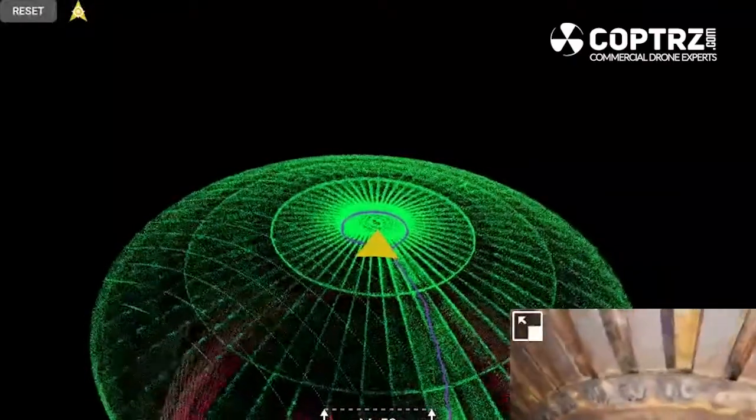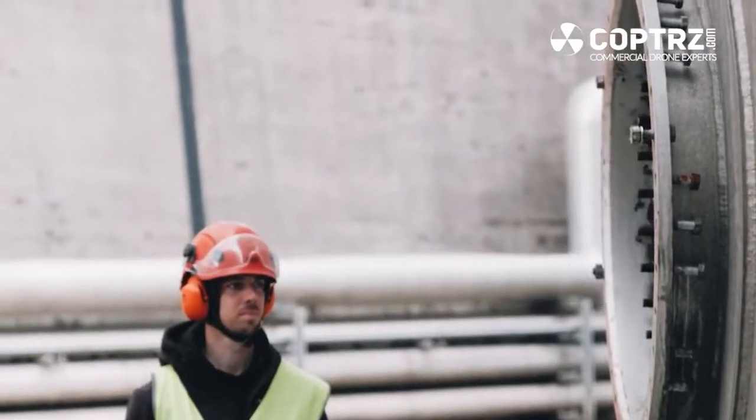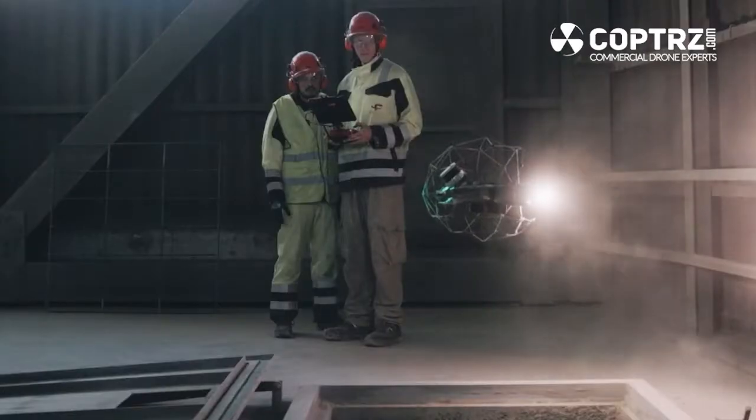Let's talk about one of the big improvements with the cameras and that is live streaming. Live streaming means what the drone is seeing and what it is being fed back to the camera operator in a mission. The Elios 2 operates on standard HD streaming whereas the Elios 3 now operates on 1920x1080p full HD streaming back to the controller. This means that if you are in any sort of inspection scenario you are going to get better data quality fed back to the controller so you don't miss anything.